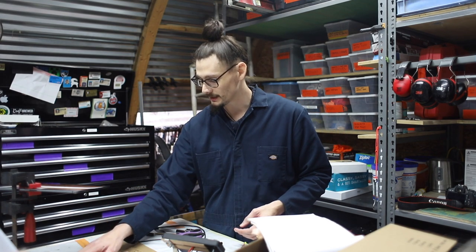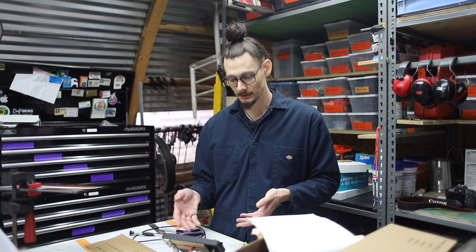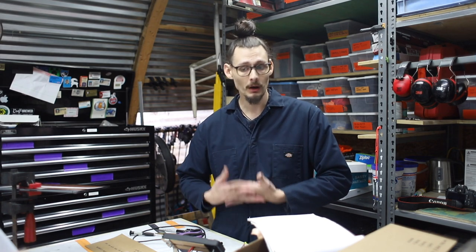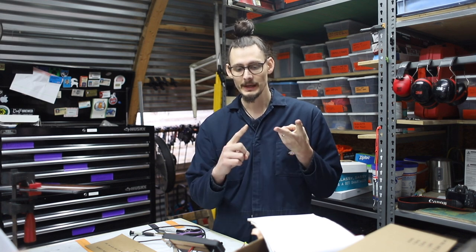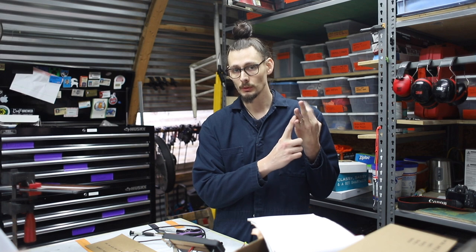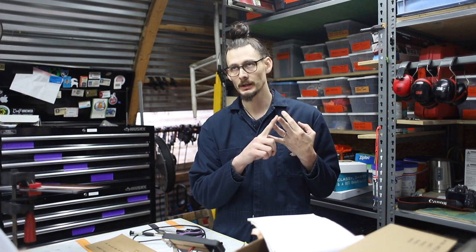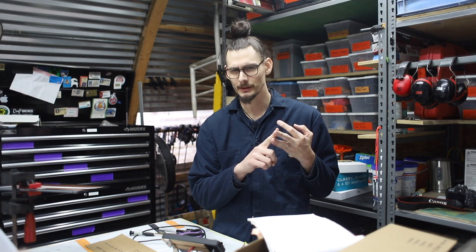So now what can we do with this? We can take all of these values and decide what we want the state of the control pad to look like. We can mix colors. We can turn colors off. So we can make a total of, I think, 7 or 8 colors. Let's just say black is a color, black is off, and white is a color, all the LEDs on. Then you go red, green, and blue, which are pure just on, and then the mixtures of all of those. So red and green would be yellow, green and blue would be the tealish color, and then there's a purplish color in there as well, I want to say.